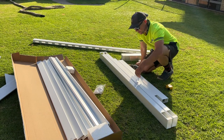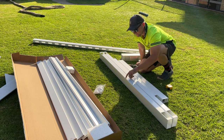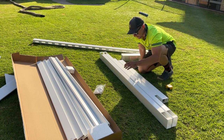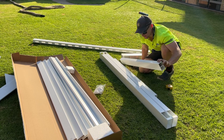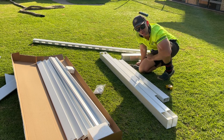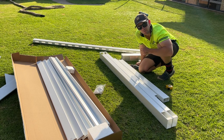Grab yourself a 10mm drill bit and come in from the corner about 5mm approximately. By drilling a hole in each of the corners, you get a nice little curve on the edges so it matches your top, bottom, and mid rail, giving you that slot that just slots in perfectly. You're better to come in further inside the post rather than too close to the edge when you're drilling the hole.